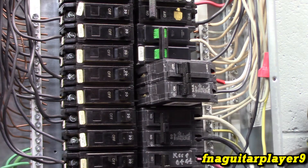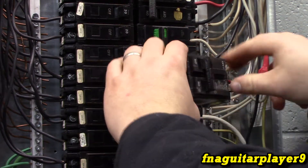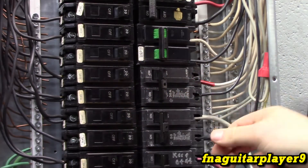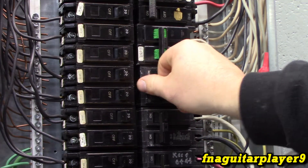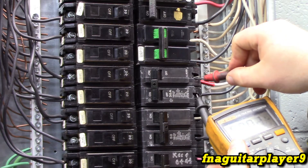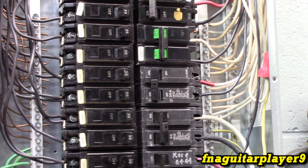I'm going to point out something else with the old breaker in a second. Make sure the breaker is off and preferably the main power is off in this box. Get it hooked and pop it in. If that was the problem, the heater should come on now — she's starting up. So that took care of it. Now we should be reading 240 across the two legs — and we are. It's reading 238 volts, so we're right where it needs to be.